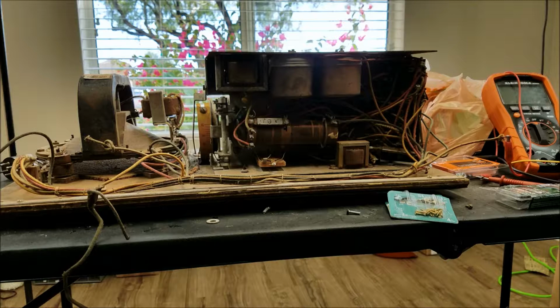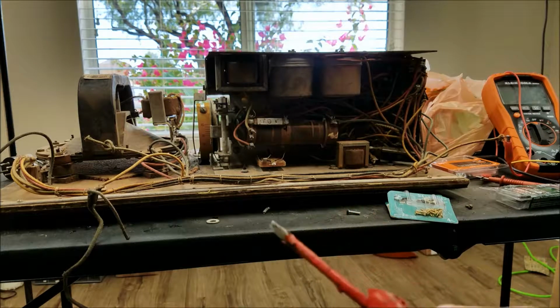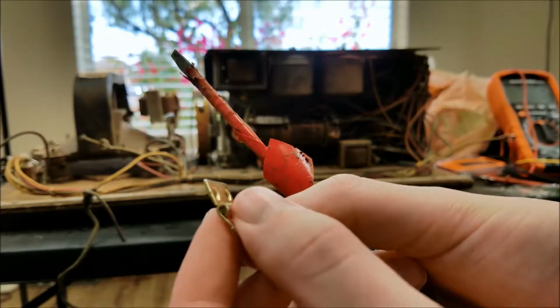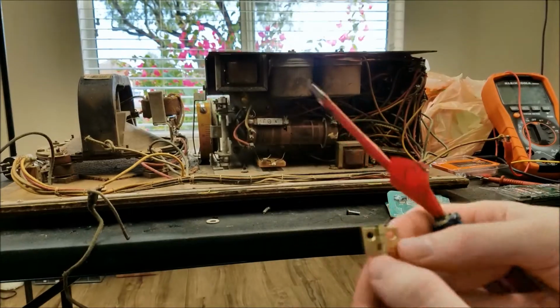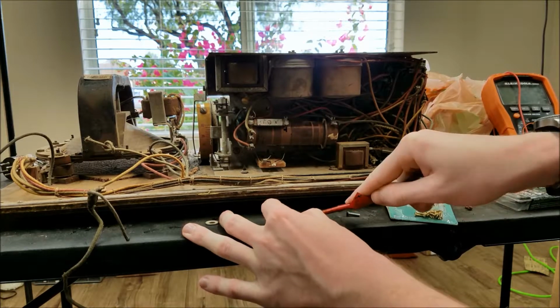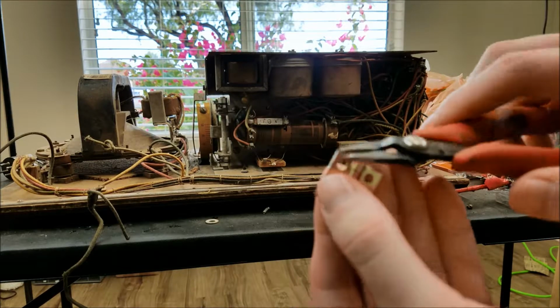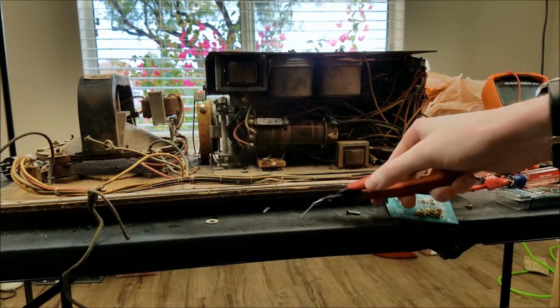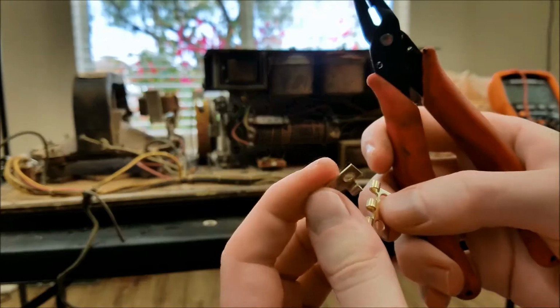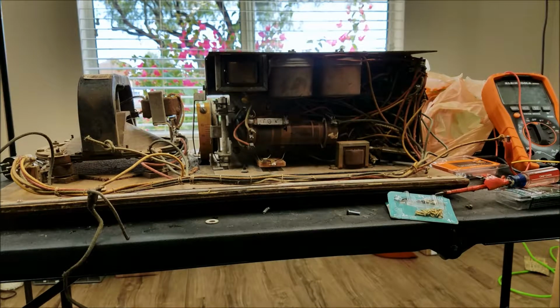So what I found you can do, what I'm going to do is you find the big end of the pin, so that's the small end there, you can see that one's all the way, and this is the big fat end, and then on that part of the hinge just pry up a little bit, and then you should be able to take some pliers and pull the pin out like that. Then you just take this and flip it around, put the pin back in,